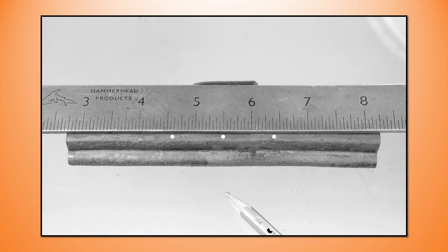So I've got my 5 9/16 or 5.5 inches of collaring stock. First thing I'm going to do is find center, and then I'm going to measure out half of the width of the stock to be collared. It was 1 3/4 we said. So half of that is 7/8. I'm going to add to that half the thickness, so the neutral axis of my collar, which should be 5/32, I suppose, in theory. As that's half the 5/16 supposed thickness.